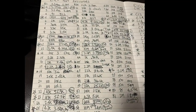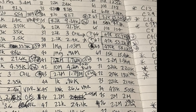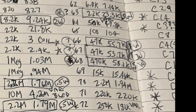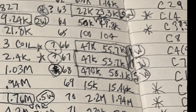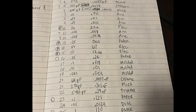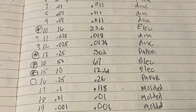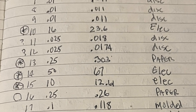Another thing I decided to do while waiting for the delivery of the caps, and while under a strict prohibition against powering up the scope, was to take measurements where I could, primarily resistance and capacitance readings. I actually measured them in circuit, and although one can rightly argue the validity of this approach, it was a quick one or two hour task that in some cases did point to areas warranting a closer look.